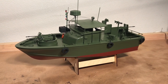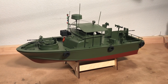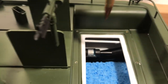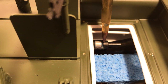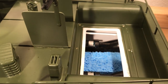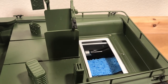First and foremost for me is seaworthiness. I want to make sure that I get the least possible amount of water in this boat. Certainly you're going to get some water inside, and particularly that's going to come from your engine compartment where the drive shaft comes through and marries up with the engine coupler. That gap is where water will often end up spitting out into your hull. You can try to pack it with grease, but that only does so much good, and you need to service your drive shafts and grease those whenever possible.